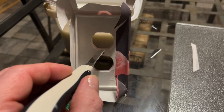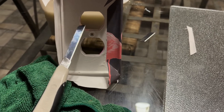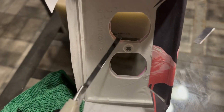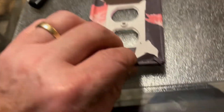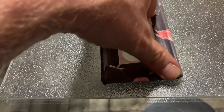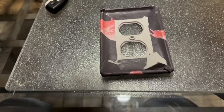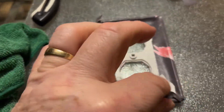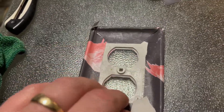You don't want it right up against the opening, so you cut it at an angle — this way it covers the white that is on the inner part of the opening. After I get my wallpaper basically in place, with two hands I start pressing down on the material against the backing. Now this is going to take two hands, although for the video I'm using one and holding the camera with the other.